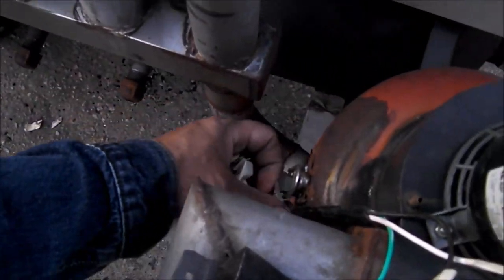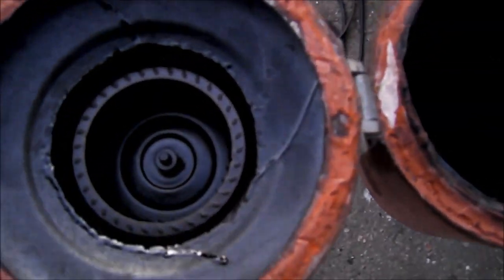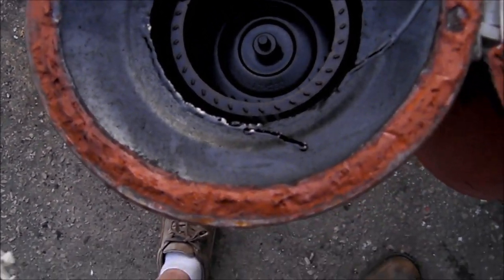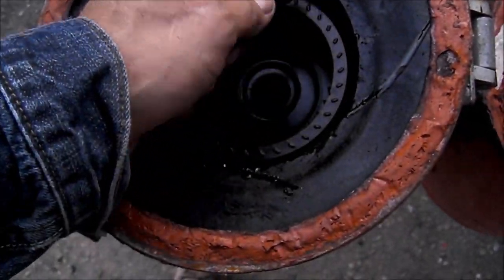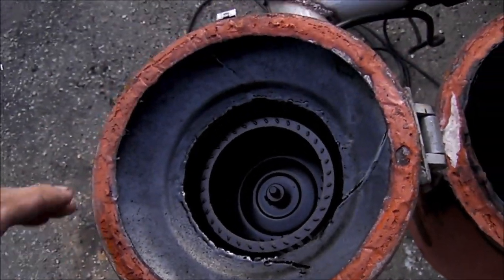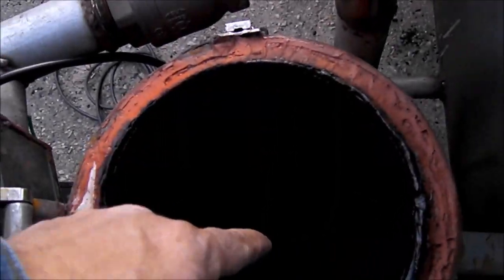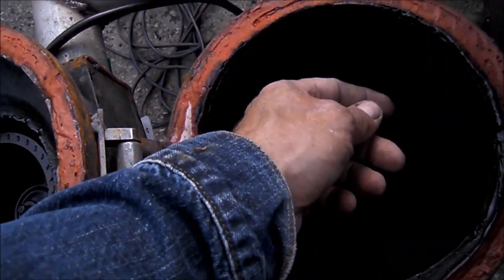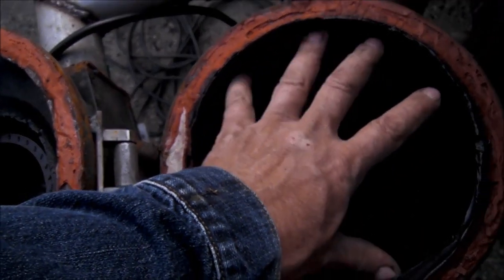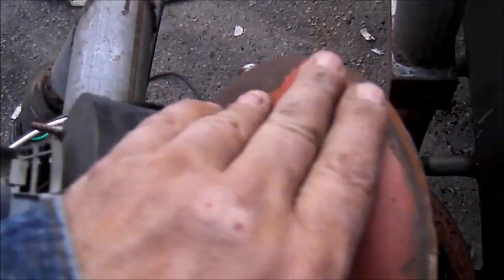This is the latch and this just opens up. You can see there's the fan, and this here is actually tar from wood — it's like creosote, this black shiny stuff. It's obviously coated the fan. The reason why all this has happened is because this canister should be full of wood chips, so that all that black tarry smoke comes in here and that filter medium filters all the tars out. When it goes through this fan, it actually comes out clean.